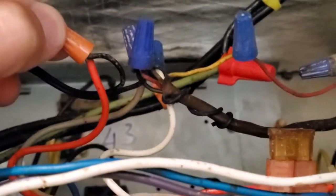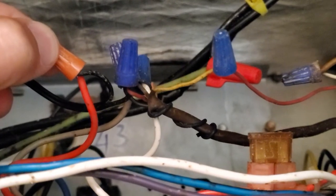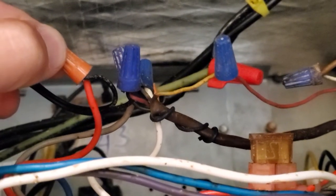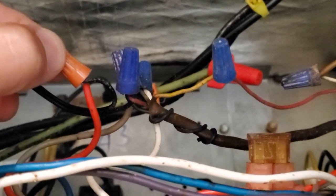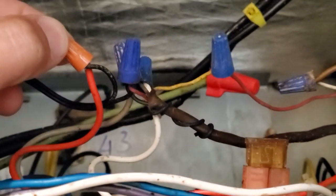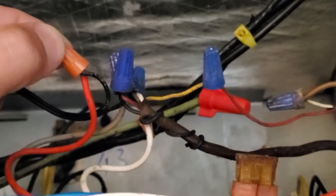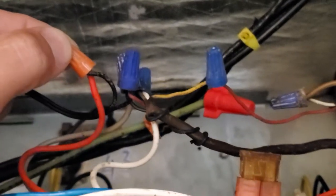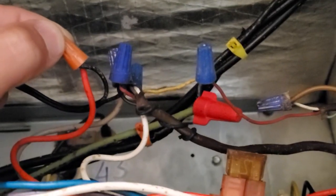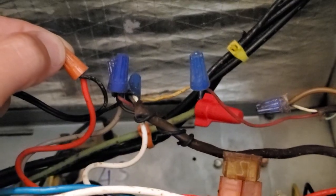What happens is if the safety switch engages, it cuts off power, your unit stops — turns off the entire unit — and there is no fan working. This is basically how you need to connect it. I hope this video helps you in connecting your AC safety switch. Thanks for watching!